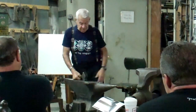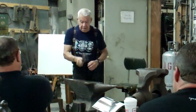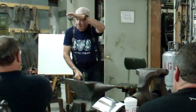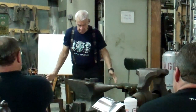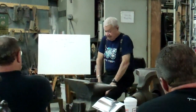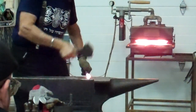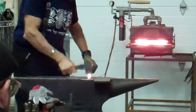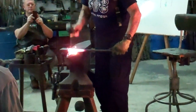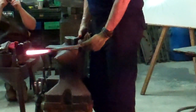So you stand like this, the body is 45 degrees to the anvil, you raise the hammer and you go free, up and down, this way. Mainly, we raise the hammer until the head level. Okay? So this is regarding how we stand towards the anvil. Now, John, let's start to make fire.